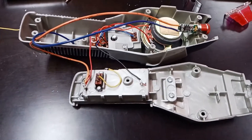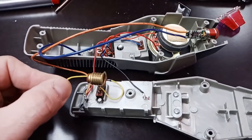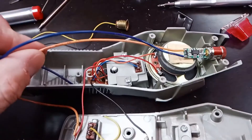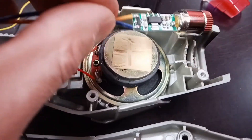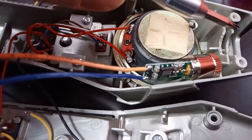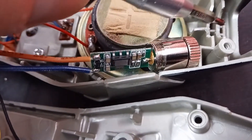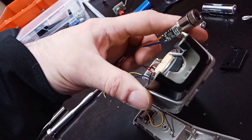So here's what I did. There wasn't much electronically that needed to be modified in this case. All I really did was remove the light bulb from the circuit and replace it with this quarter watt laser, which happens to just fit into the old light bulb mount with just a little bit of hollowing out for flushing. The way the light bulb was fixed, there are two lips that held it in place. The first one is rounded and was the perfect size and match for the laser's diameter, but the one on the inside was slightly larger. So I had to hollow out part of that to make it nice and smooth to accommodate the laser, and once that was done, everything fit together quite nicely.